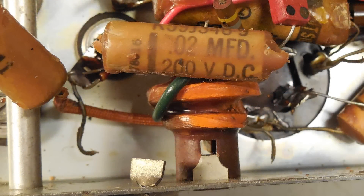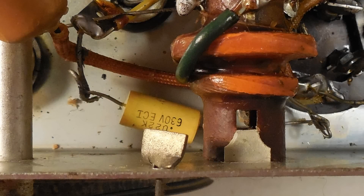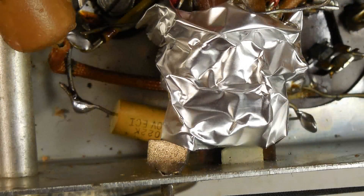I left a length of wire on either side. That capacitor sitting on top of the coil is the one I just took out, and there's the replacement. I'm hooking them together at one end, then the other end. Now it's time to solder — any time I'm close to a coil with a soldering iron, it's a good idea to wrap that coil temporarily in aluminum foil.